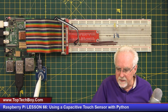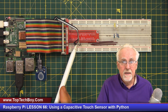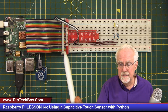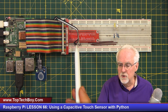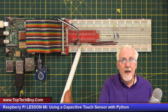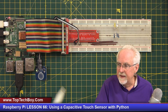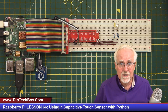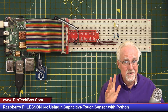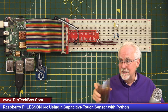The leftmost pin is the signal pin — I brought it over to GPIO pin 17 in the BCM numbering system. If you're using this breakout board it's labeled in the BCM system, so you just bring that wire directly into pin 17. The center pin labeled VCC goes to 3.3 volts, and the rightmost pin labeled ground goes to ground. At this point the sensor is hooked up, and that's pretty easy. Even the most beginner of you should be able to hook that up.